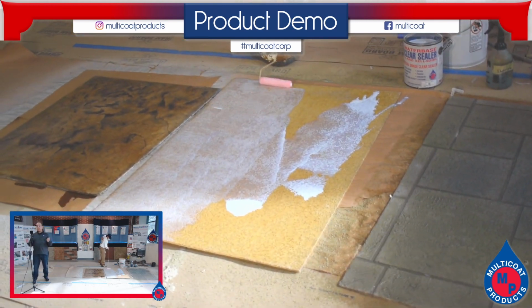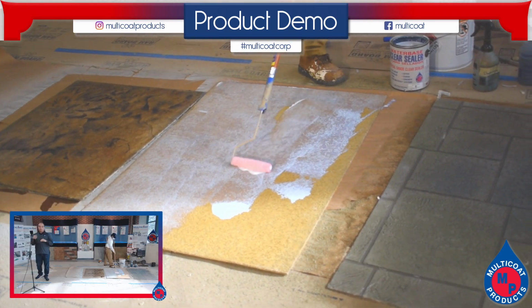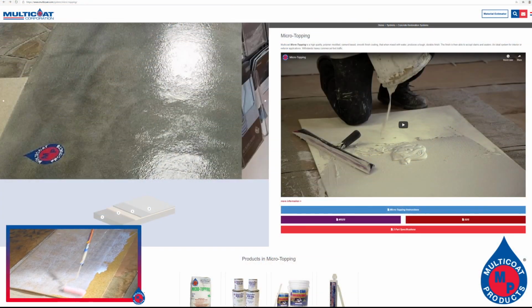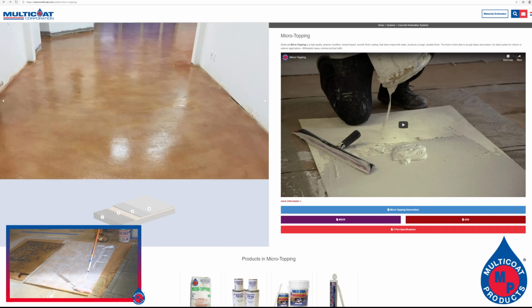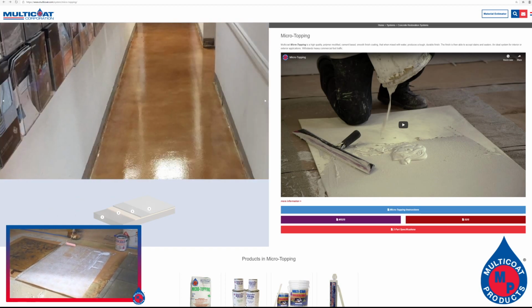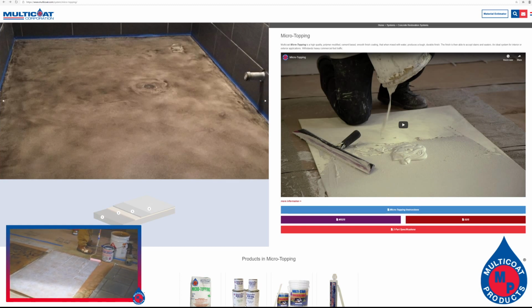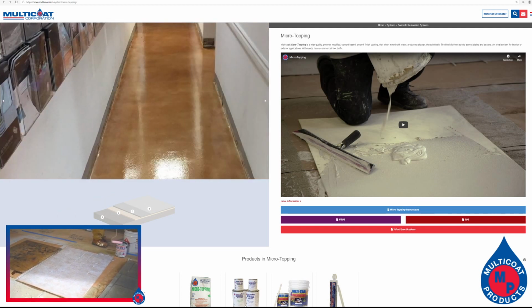I want to go back and talk about our microtopping coatings. Our microtopping we showed earlier when we were showing the slide of our stencils and our stamp. But as you can see in the pictures showing now, our microtopping will give you a high impact interior finish for interior coatings, whether it be a house, a yoga studio, a restaurant, a bar, an office. Gives you a really sharp look. It's a really thin coating, but really durable, easy to stain or apply color, seal in one of our sealers. And as you can see in those pictures, microtopping comes in a 50-pound bag, and you get anywhere between 100 to 300 square feet of coverage.